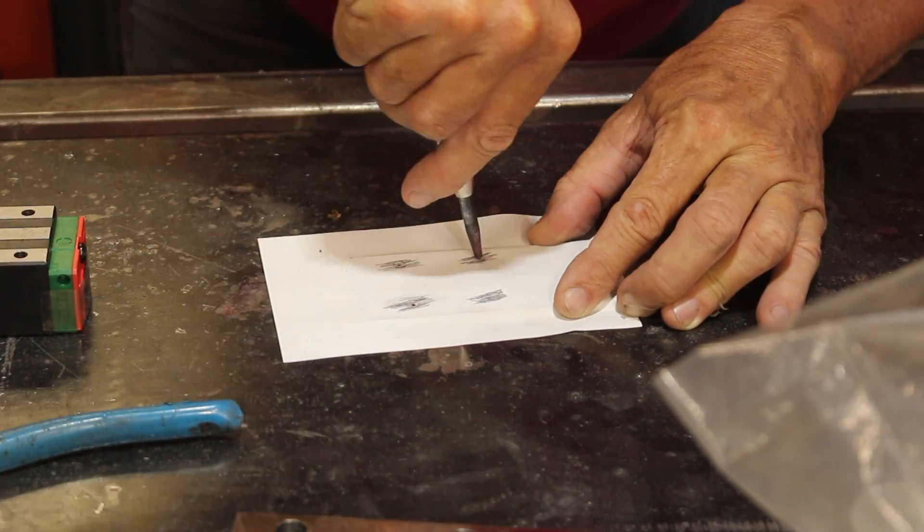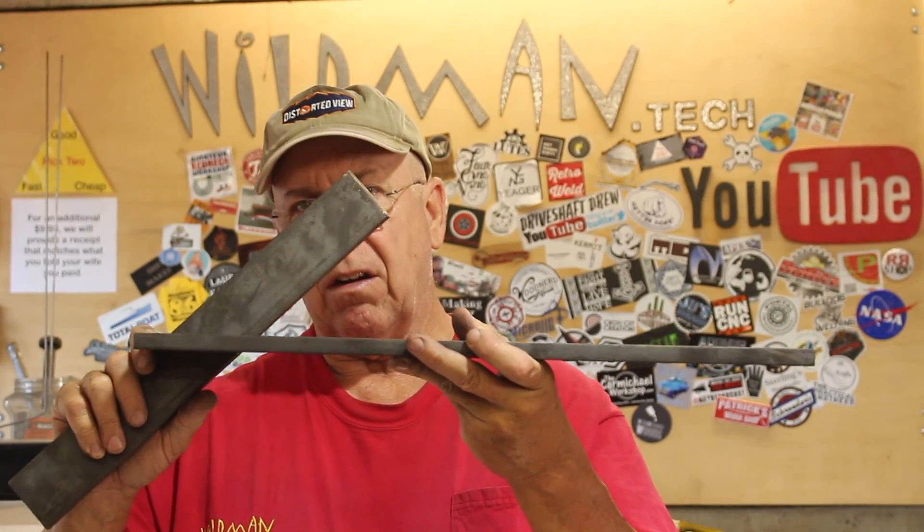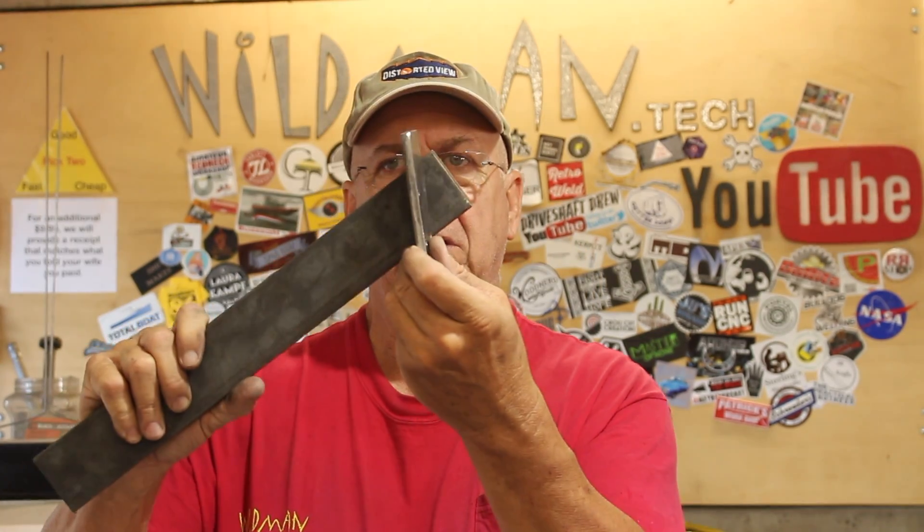I can see where the holes are. I went to the steel yard with the vision of my CAD model in mind, but one of the first things that occurred to me is that in the CAD model the ram is right next to the upright tower — and that's not good because that would mean the hole could only be about an inch from the edge of the metal I'm punching. I want more range than that. So I have a piece of half-by-three-inch bar, and I'm going to put the tower at one end so when I pull on it with a lever, it can sit on a bench and maybe not even need to be clamped down. I'll cut some 45-degree angles and weld the tower at one end to get three or four inches of reach into the middle of the plate. Here I've made the mounting plate for the bearing, and we'll just weld it onto the tower.